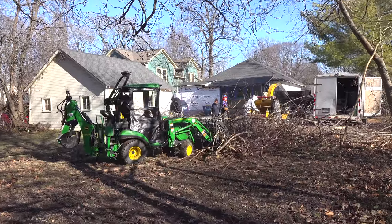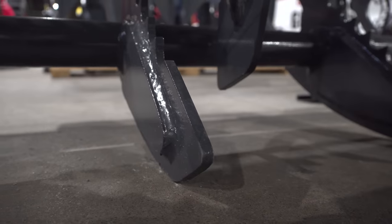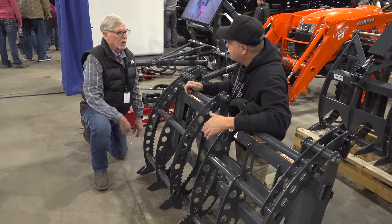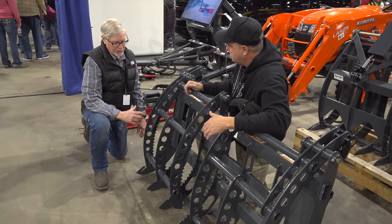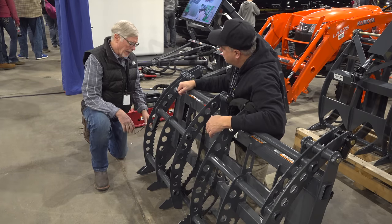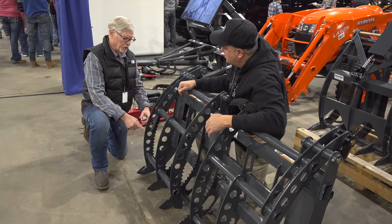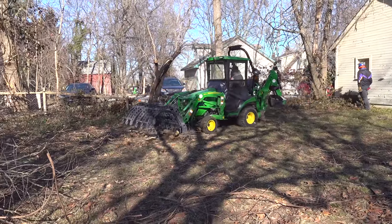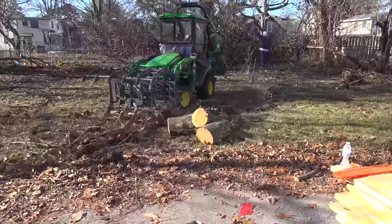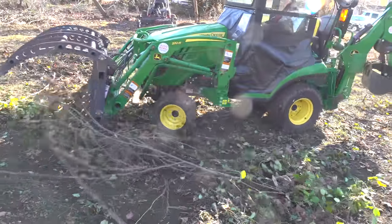So I'm not going to break that ram if I just push hard on it. That's correct. Another important feature you'll find on all of our grapple rakes is we reinforce every tine. On the end tines, they're the ones that get the most push and twist, so we reinforce it on both sides — that about doubles the strength on the tines. We don't use gussets to try to strengthen them, because gussets have a tendency to dig in deep into the dirt. What we want to do is float right along the top, rake up the brush and debris, let it windrow up into the opening of the grapple, then you clamp down on it. Just skimming right along the top of the grass or the dirt.